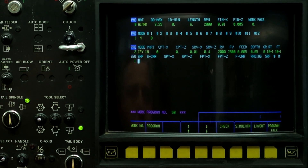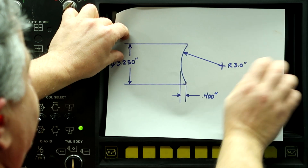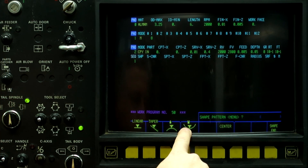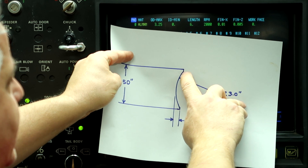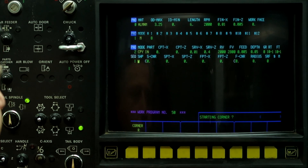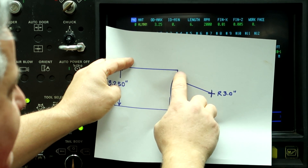Alright, let's go back to the program. First thing we need to do is pick a shape that looks like the concave radius. This symbol is for the concave radius. Starting corner — I can put a small radius right here to break that edge so it's not sharp, or I can leave it blank to have a sharp corner. So the starting corner can have a radius or chamfer, but we're just going to leave it blank.